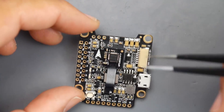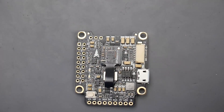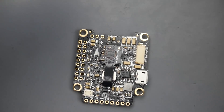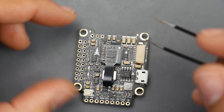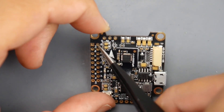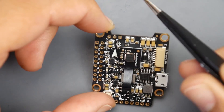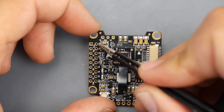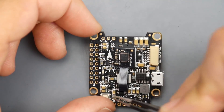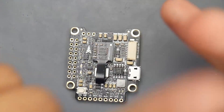For the VTX there are two types: 5V VTXs and battery voltage VTXs. If your VTX says power input is 7 volts and above, that's battery voltage. If it says 5V, you'll use a 5V pad. For a battery voltage VTX, connect the black wire to ground, the red wire to the battery voltage pad, and the yellow wire to video output. For a 5V VTX, the red wire goes to a 5V pad instead - you can share that with the camera pads, or grab a 5V pad from elsewhere on the board.